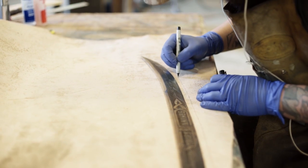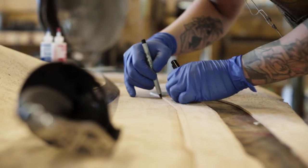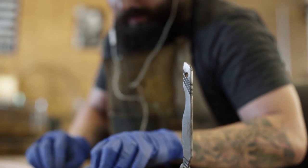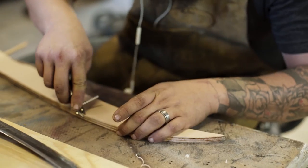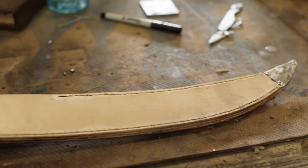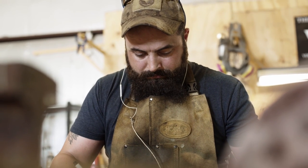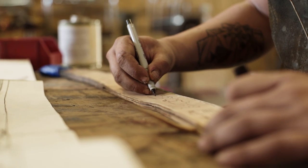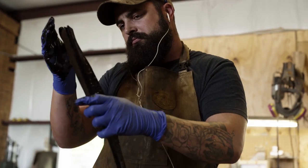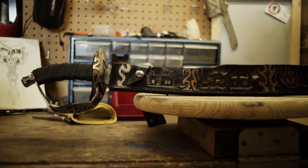Because of the drastic sweep in the blade, we can't do a traditional sheath, so we're doing a hybrid sheath with more of an open back. Once everything is profiled out and the pattern is done, we glue it together, set the stitch holes, and start stitching. After it's stitched, I stain the whole sheath black and go back in with engravers and burrs to create more relief and contrast in the artwork, per the client's design request.